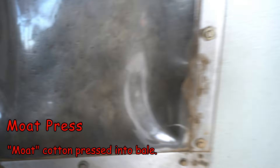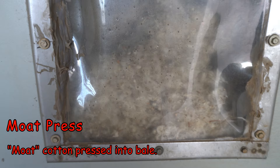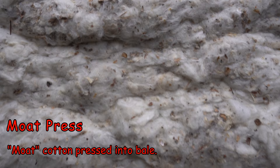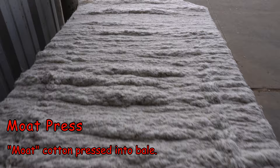This is what's called the mote — all of the lower-quality cotton, the short length that comes off the seeds, the little bits that are left over as it runs through the whole ginning process. It's not better-quality cotton — it's all collected in this area. This machine is separating out the seeds, which go off to be sold to seed mills. The mote bale gets all that compressed together and, dirty as it is, it's used in furniture and for archery targets.